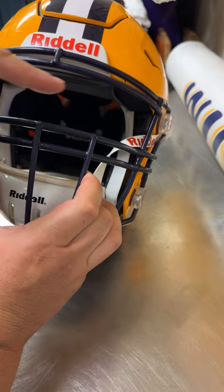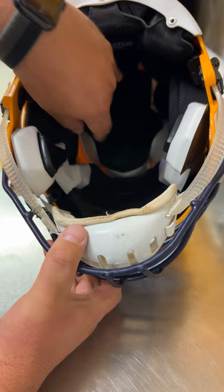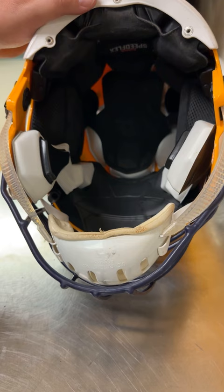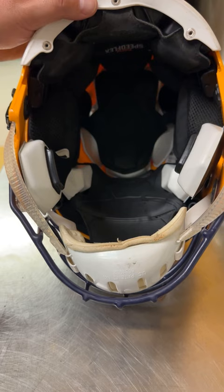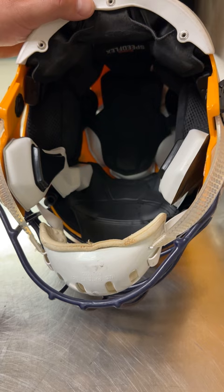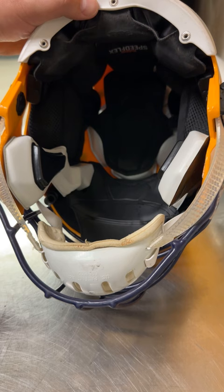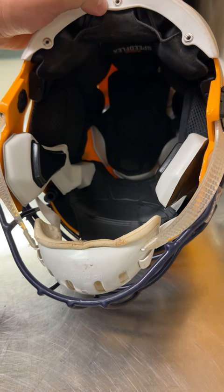There you have it. You've got the short tube with the 70-degree outlet popping out. You can adjust where it resides inside the cavity of the blower — move it a little closer to the front of your face or farther back, giving you some flex on the tube length. If it's not sticking out far enough and you want air blown farther down, grab one of the medium or long length tubes. Try a few different configurations and figure out what feels best for you. It's all personal preference — whether you want it up high on the forehead or closer to your nose and mouth or cheekbone. If you wear a visor, the tube outlets articulate and can rotate 360 degrees, so you can rotate the outlet to blow straight on your visor, defog it, and make it cooler and more comfortable. Make sure you try a few different configurations and figure out what feels best for you.